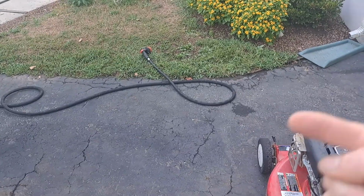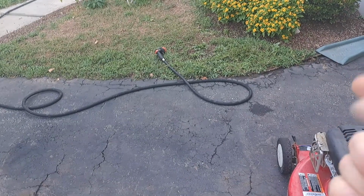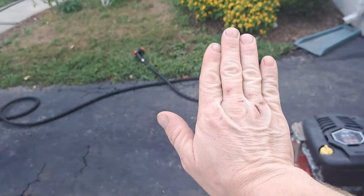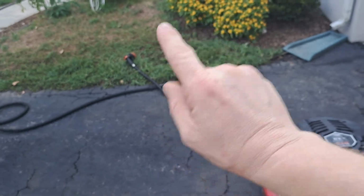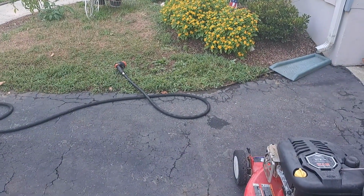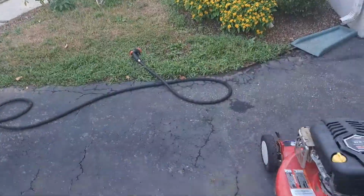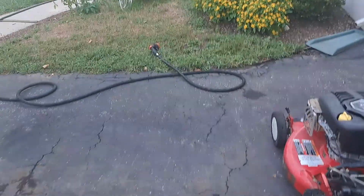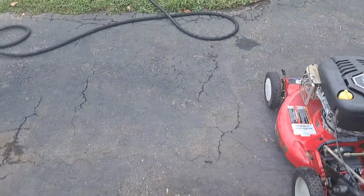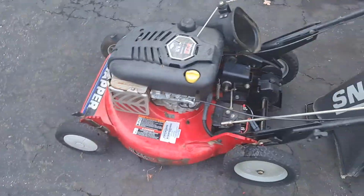The engine powers it via the belt. That turns the metal plate, and then when the rubber makes contact with the rubber plate, which is turning, that turns the drive, the axle, because there's a chain on the sprocket, comes down, and that's your drive, and that's how you get movement. Now, the only difference on a snowblower is you have reverse. So you would have to come up this way, and go to the other side of the plate for a reverse. So that's the system.